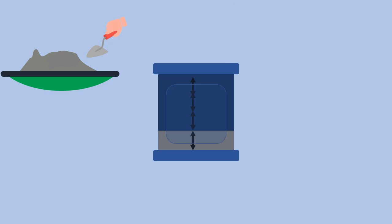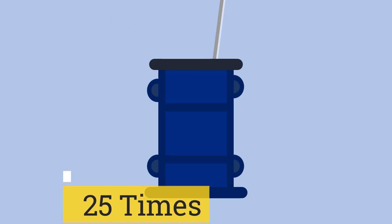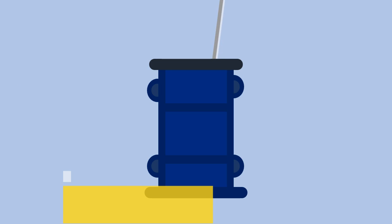The prepared fresh concrete is then filled in the mold in 4 layers. After filling each layer, tamping should be done 35 times for cube and 25 times for cylinder using a standard tamping rod. Once the mold is filled, level off the top surface with a trowel.